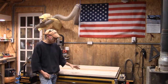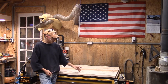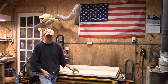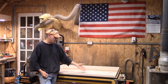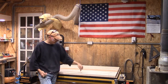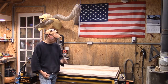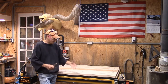The one thing you've got to remember is when you get ready to do your cutout in VCarve Pro, make sure that you do the offset. If not, you're going to click on the outside path to cut — you want to cut on the outside of the path — but if you don't do the offset, you'll cut that bevel right out. Whatever your depth is, I went 187 thousandths — three-sixteenths deep — so I've got a beautiful chamfer all the way around. But when it comes time to cut out, you also need to remember to offset that bit 187 thousandths, because if not, it will cut your edge off.